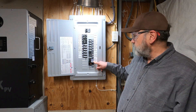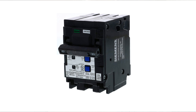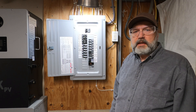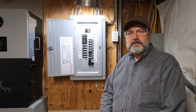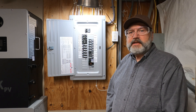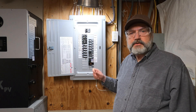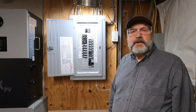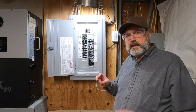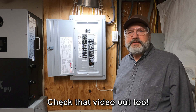Since I did use a double circuit breaker on the two kitchen circuits — it's actually a multi-wire branch circuit — everything should have been fine. But we had the microwave plugged into this circuit, and five out of ten times when we used the microwave, the AFCI double-pole breaker tripped. So I got into troubleshooting these AFCI nuisance trips, much like I did in the previous AFCI video.